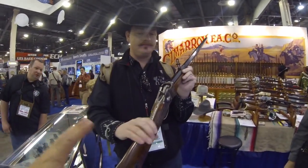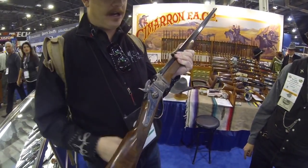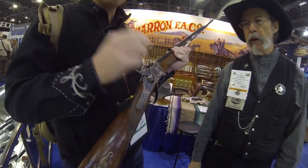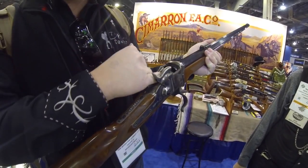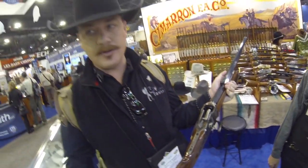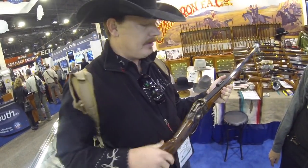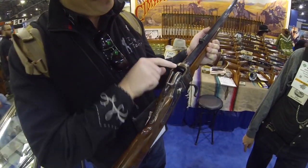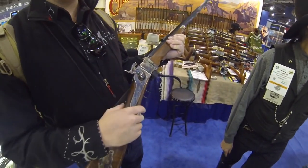I don't have any experience with this. How do you run the action? How do you load it, how do you eject it? This is a breech-loading rifle. The rifle's already on half-cock, which is important — you don't want to open this with the hammer all the way down or it can damage the firing pin, because the firing pin sticks out just a little bit on this block. So basically, you just take this lever and pull it down and it drops this falling block action. Falling block actions are among the most rugged actions in the world — look at the Ruger No. 1, that's where it comes from. So you just insert the cartridge there. When you bring that lever down, does it eject the old cartridge? Yep, and you'll see that right here — here's your ejector. You know what that reminds me of? It reminds me of an artillery piece. It kind of acts like one — a smaller version of it.